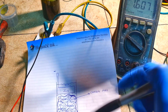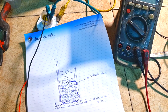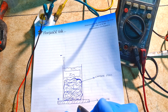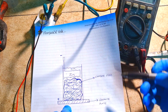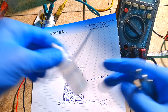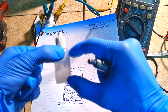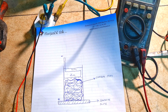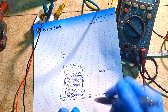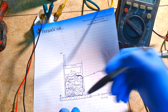Now the construction of this cell. On the bottom I use some graphite plate, and this graphite plate serves as the positive current collector. On this graphite plate I glue some housing — I made this housing by cutting the top and the bottom of a container, and this section I glued with some silicone sealant to the graphite plate. In this housing I put some carbon foam; the carbon foam is there to increase the surface area.